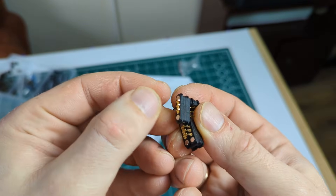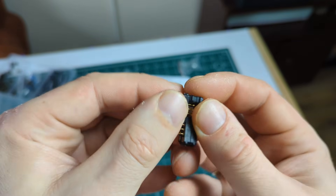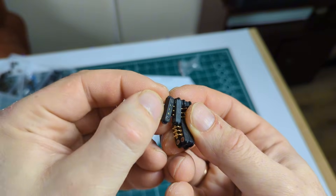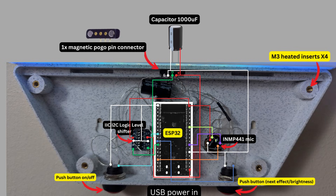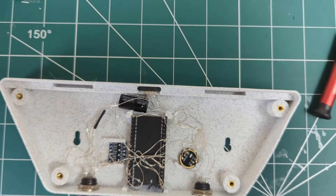The main backbone that makes the panels modular is these magnetic pogo pin connectors with three pins, which is ideal because we're using WS2812B LED strips that require a three-pin connection. One thing to keep in mind: these magnetic connectors are rated only for two amps, so don't go too crazy on the power. And of course, a 1000 microfarad capacitor.